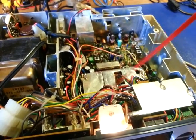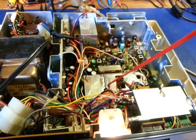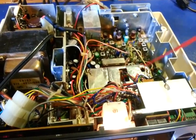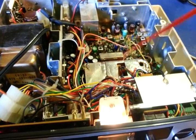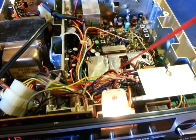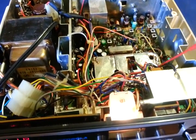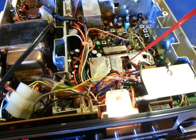There's no longer a gigantic gaping hole here. I took a piece of double-sided copper clad circuit board — it's been tinned on both sides, that's why it doesn't look like copper — and soldered it down over that gaping hole which went from here on up across and down. It's back to the size it should be, with just the access hole for the plug and test points.